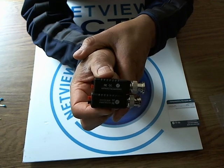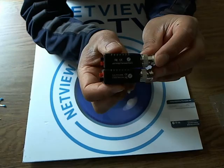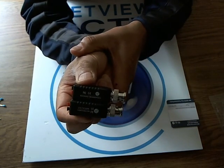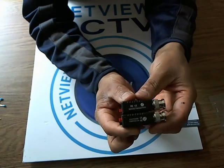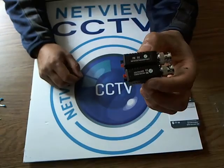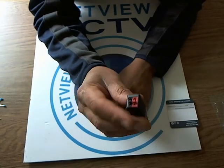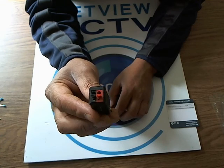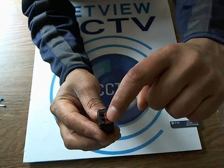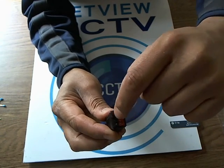For TVI, it'll give you 300 meters for 720p video, and up to 200 meters for 1080p video. It's compatible with all analog HD video. These baluns come with push-fit connectors on the back, making it very easy to connect your cables — just push the little buttons on the back and push the cables in.